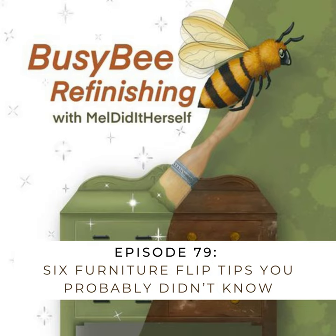Furniture flip tip number four. We know when sanding a piece, we want to start with lower grits — maybe 80, 100, 120 — and work our way up to a more fine grit because that's going to smooth out the surface and open up those wood pores so they're nice and silky smooth and ready to accept whatever is going on them, whether it be a wood conditioner, a stain, a top coat, et cetera.